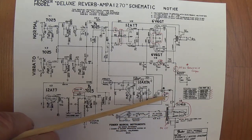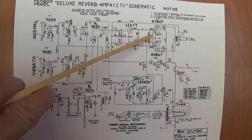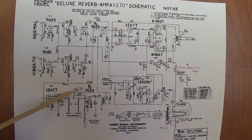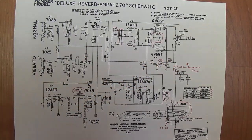Negative DC power supply filtration, that nodal resistor, grid capacitors to filter off ultra-high frequencies, and this capacitor over here, which would eliminate high frequencies from the reverb. So if you go to 1270, you're in good shape. Listen to what I said about the 1172 and ignore the part about moving the standby switch.